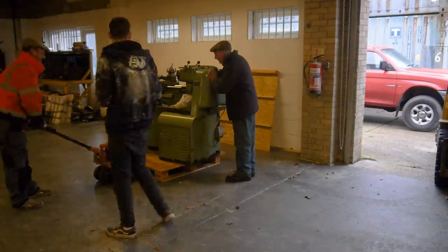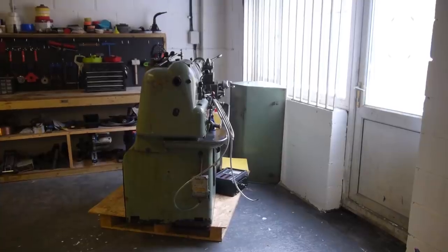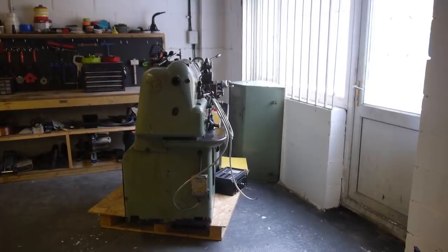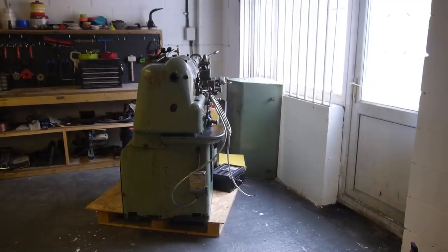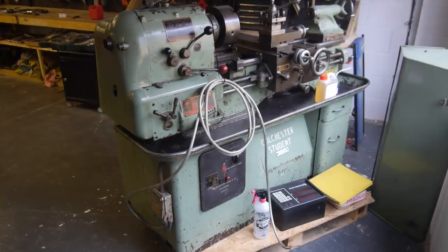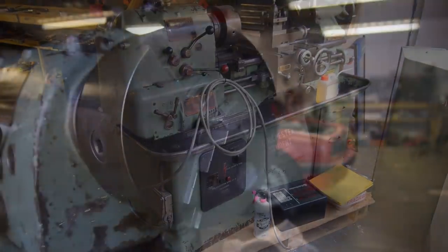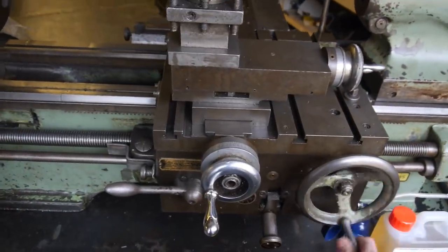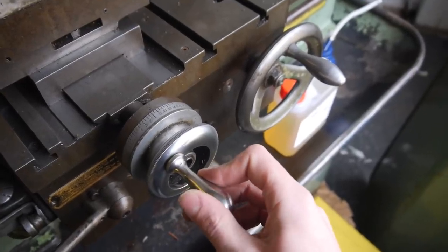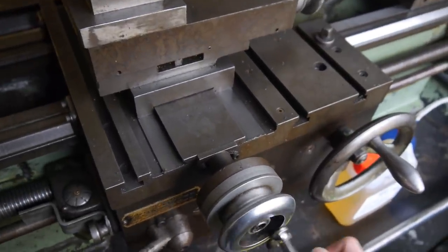Whilst I paid for the goods on the phone, it was shifted more towards its final resting place which would involve moving a workbench. I wanted to use the natural light from this window at the back to light the lathe during the day when most, if not all, of the work would be carried out. Obviously it would be turned around with its back up against the window. So this is a Colchester Student Mark 1 from 1951, which makes it 70 years old this year. It's a 6 inch lathe, which refers to the centre height, and the bed length between the centres is 24 inches, so it's known as a 6 by 24 inch lathe. It's a 3-phase, I think 380 maybe 415 volt motor that needs to be hooked up to the 3-phase the workshop has.